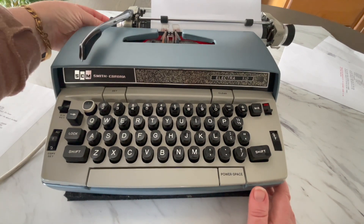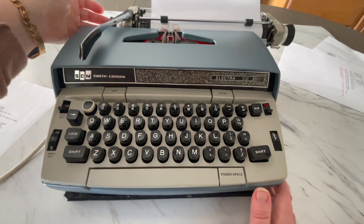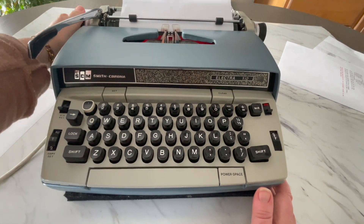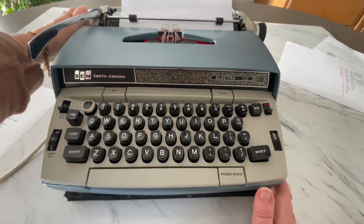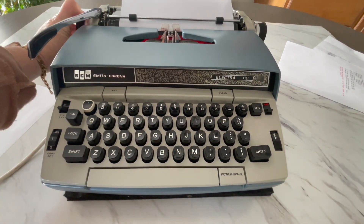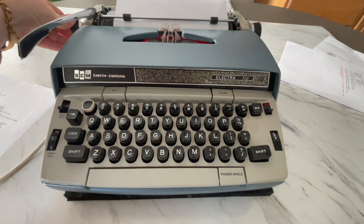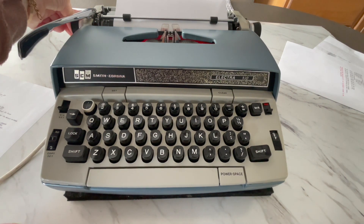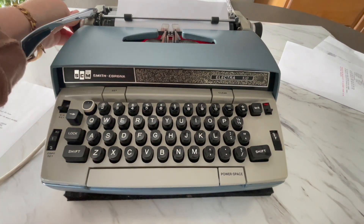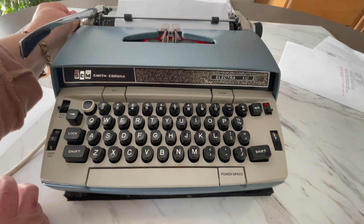Over here on the left side, you'll notice the handle on this side has kind of an extra lip — it's actually a button. What that is for is when you turn the handle on your typewriter, you'll hear it click every half of a line, but sometimes it's not lining up exactly where you want. So this is for variable spacing or roller release. You press it in, and now you can turn that roller — it frees it up so you can place it wherever you want, and then you release.